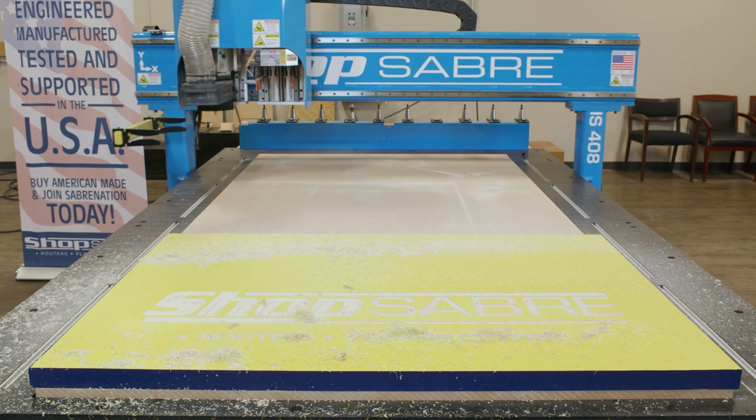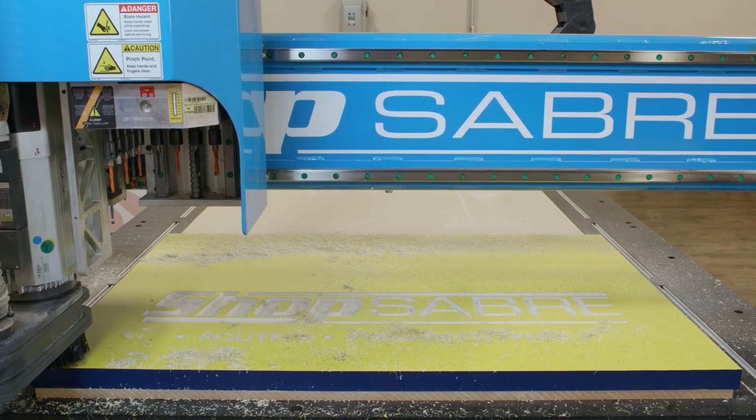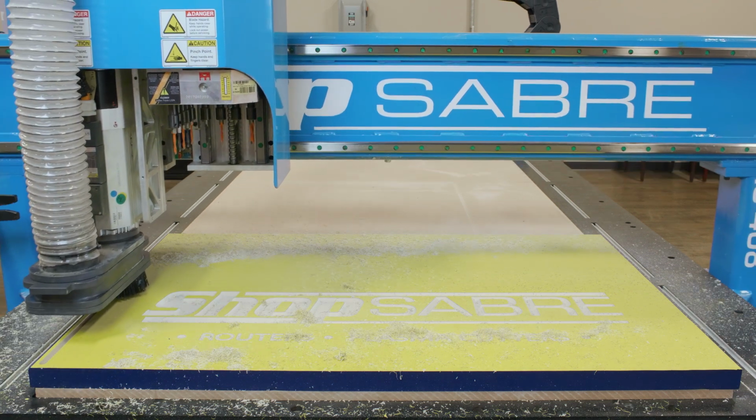Finally, the outside of the shape is defined. Since our material is so thick, we're going to do roughing passes followed by a finish pass. That'll give us a better edge finish.